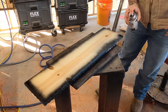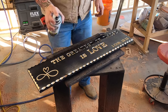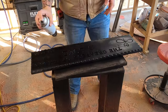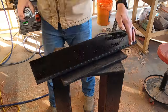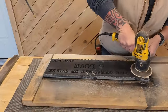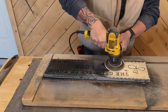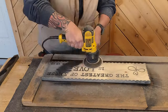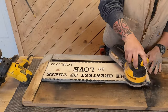After all the carving is done, we use our primer — priming the back where I did a small bevel, then spraying the front. I made a mistake and didn't put any clear on first, because this is blue pine and it did bleed a little bit. Luckily, blue pine has those dark streaks so you couldn't really tell. Once it was all dry, I used our 60-grit disc on the disc sander to remove 90–95% of the black, then our 120-grit on a random orbital to give it a smooth finish and prep it for clear coat.